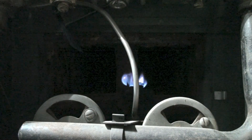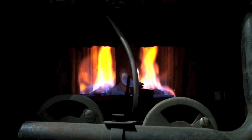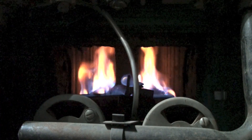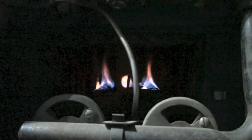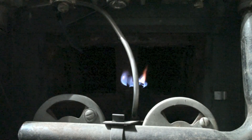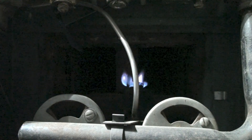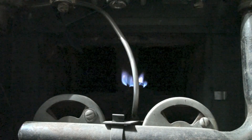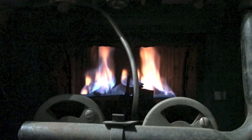Now I'm going to go ahead and light this thing off and let's see how it lights. You can see it lit fairly well, but the left burner did not light immediately. Watch that left burner — you can see the front part of it lights but the back doesn't. Every once in a while it'll delay quite a while before it ignites in the back and makes a big kaboom, which makes the homeowner quite nervous, especially if he sees flame rolling out the front of his furnace.